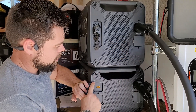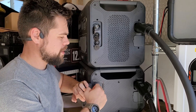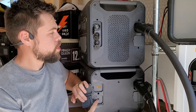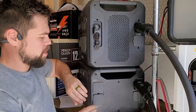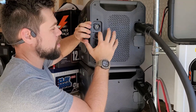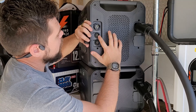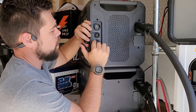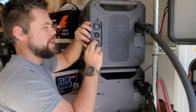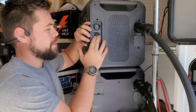We've got the solar input here — 12 to 60 volts and up to 10 amps — so I could easily connect three 200 watt solar panels. There's also the wall charger adapter, which is capable of charging from solar and the wall at the same time. The AC input can do 240 volts and 50 amps — if I remember correctly, it's a 5,000 watt AC charger. There are also two 12 to 150 volt, 15 amp charge controllers built in, with a special adapter for two separate solar arrays up to 3,000 watts.